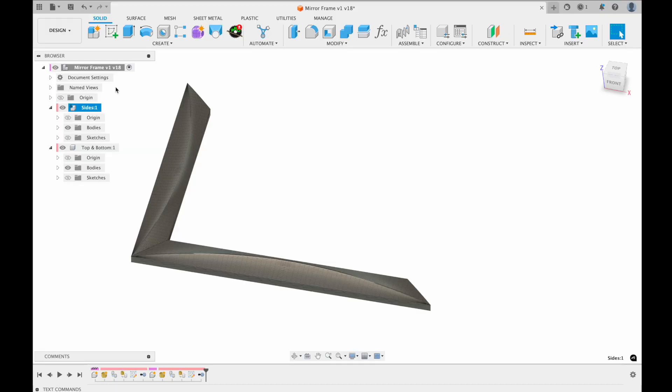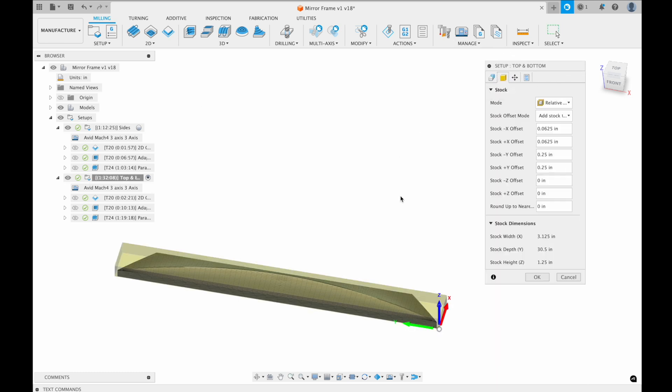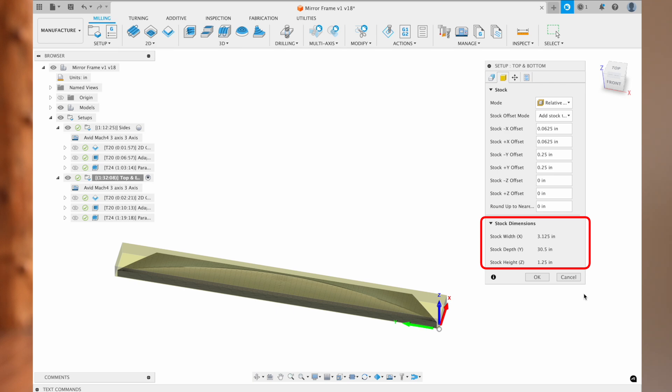Before I jump into the CNC, let me talk about what size I'm making my stock pieces. I'm doing all my CAM or tool paths in Fusion 360. If I go over to my manufacturing tab, I can double-click on a setup and click on my stock. For this particular project, I'm using a relative size stock and I'm adding some on the sides — the X and the Y. The stock dimensions are the size I'm targeting for my rough stock. My Z I'm making just a little bit thicker than what's shown — here it's 1.25 inches, and I'm going to 1.26 inches, just a little bit thicker.